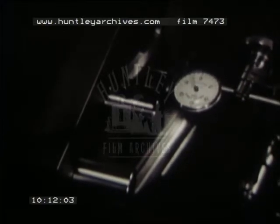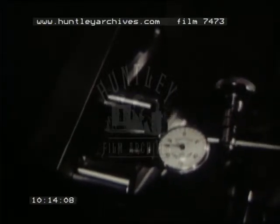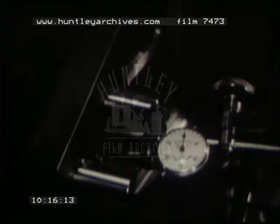Transfer the indicator from the height gauge to the studs. The readings on the dial show a deviation from the established dimension of less than 1/1000th of an inch. A deviation of 1/1000th is well within the tolerance allowed on the drawing.